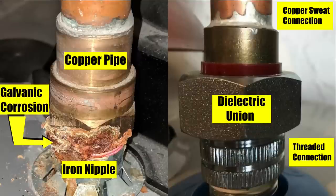For the scientists out there, let me give you the definitions. Electrolysis is the forced introduction of an electrical current in an electrolyte to cause a chemical reaction to separate the components of water. Galvanic corrosion is an electrochemical reaction that causes electrons to flow from one metal to another. Basically, you can't mix copper or brass pipe with galvanized pipe. If you do, take a look at the picture on the left — the galvanize will corrode and deteriorate on the outside and inside, eventually closing up your plumbing system.